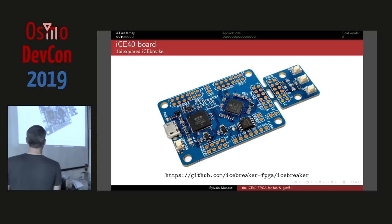And it has the FTDI, which is used for programming the flash, and once the programming is done, you can actually use it to communicate with the host to send and receive data. You can either use SPI or UART to talk to the host, or both at once, since they use different pins. You have a very large flash, like 64 megabits, I think, and the bitstream uses only 1 megabit. So if you want to put user data on there, that's very doable.